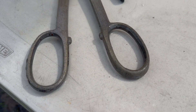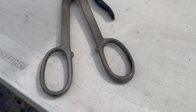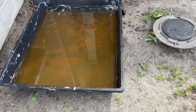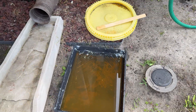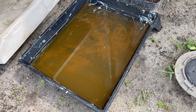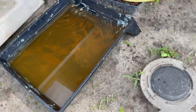All right, there we have it folks — all the corrosion and rust comes off this thing pretty easily by soaking it overnight in a 10 to 1 hydrochloric acid, or muriatic acid, solution. Just let it soak, scrub it off, and you should be good. To neutralize it and get rid of it, just pour about a tablespoon of baking soda in there — that should neutralize the acid and you can pour it out.